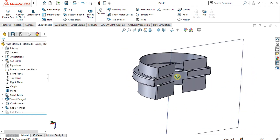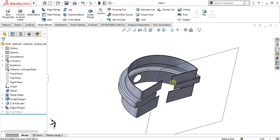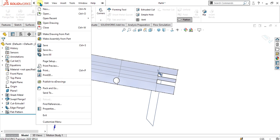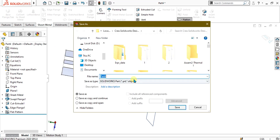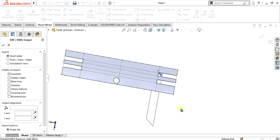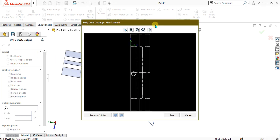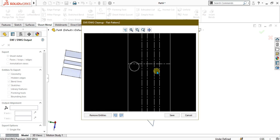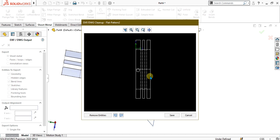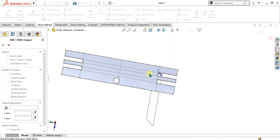I will start an exercise series for sheet metal soon, so stay tuned with the channel. Now if you want to flatten this part simply select flatten from here. If you go to file save as for manufacturing, you can select the DXF format from here and save it to your location. From here you can see it is asking for the export type — I will select sheet metal and enable titles to export our bend lines and sketches also. Select OK. Now you can see I have got the DXF file for manufacturing, or you can also generate a drawing using the drawing feature in SolidWorks. Thank you for watching, keep supporting and keep sharing our channel for more interesting videos.